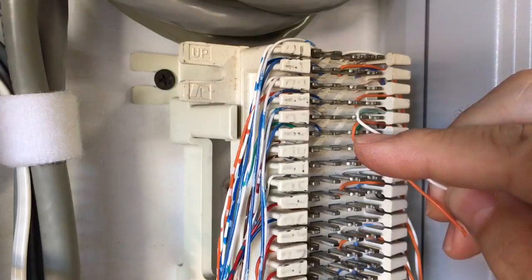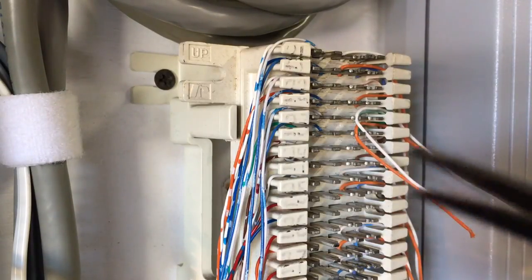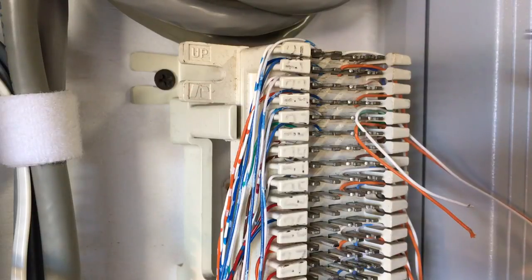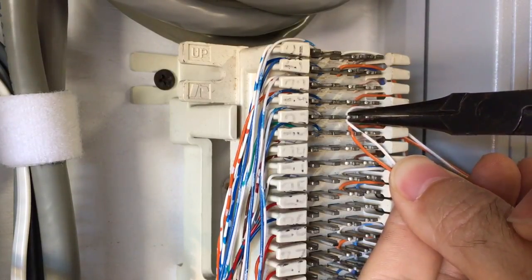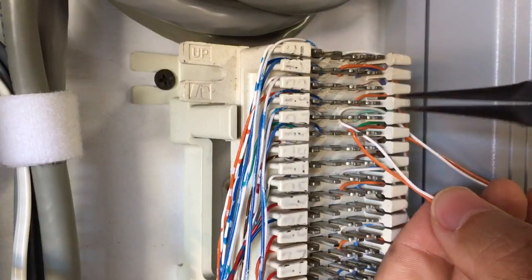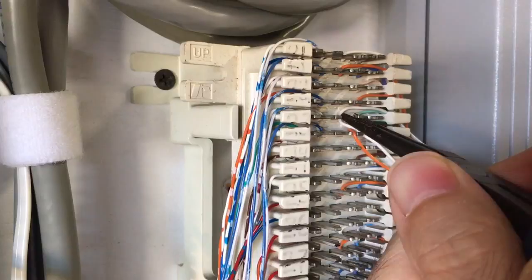The 66 tool does this very gracefully and efficiently, but in this video I'm going to show you how to do it if you don't have one. Remember I said you want your skinniest pair of needle nose pliers. I'm going to take my pliers and gently push that wire down the V all the way to the bottom — from where I initially placed it at the top, all the way to the back. Then for good measure, take your pliers and give it a little pinch, because that brings the two sides of the pin back together again.